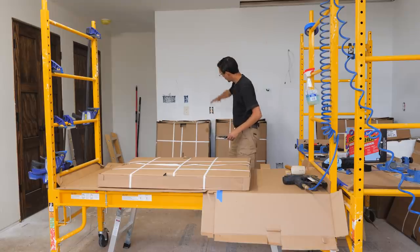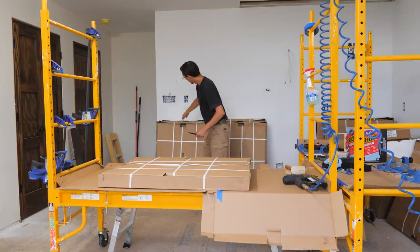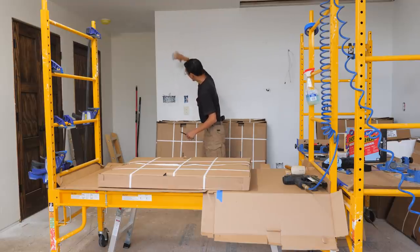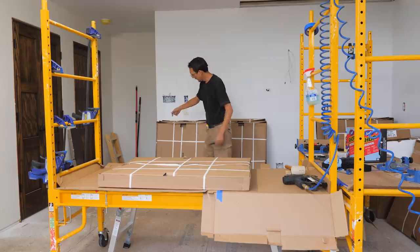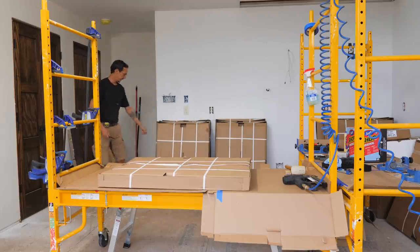because there will be a wall oven microwave combo unit, which is a tall cabinet. So the base cabinet will be right here, and there'll be a little part that's kind of like a backsplash sort of thing with the countertop here, and then another cabinet above it. But that cabinet is going to look like it has a door that opens this way, but that's a fake applied panel. It's just a door that we glue on, and the actual door opens over here.